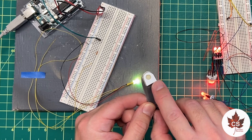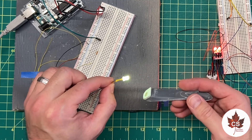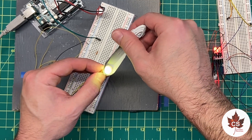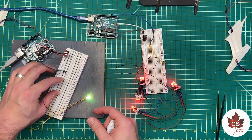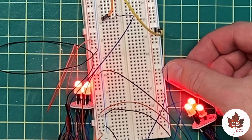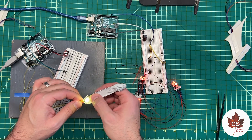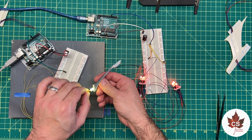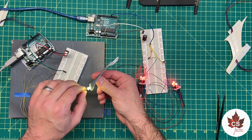We now have a piece of white styrene on the back and that's going to help us with our light blocking. I've shaved down the end of this LED flat and slightly angled. It's going to go on the back there and we're going to get a really nice yellow glow on that deflector. The wires are literally just shoved into the breadboard here. All of these wires have leads from LEDs soldered onto the ends so that they can go into the breadboard better for testing. These are just the bare wires, so if they short out that is why — there's nothing wrong with the LED. We will encase the back of the LED for light blocking purposes, and this will work out very well for giving us that nice bright yellow glow on the deflector dish without leaking any yellow light back into the ship.